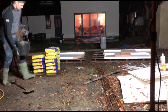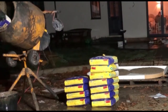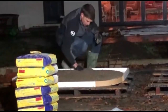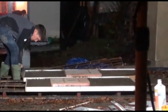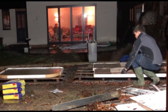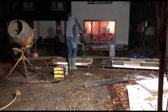I'm mixing up 40 newton bags of high strength concrete with 0.5% plasticizer and just adding enough water to make the mixture sloppy without any water pooling on top — this would be around 4000 psi concrete if you're from America. Once you've filled the molds to about three quarters full, bounce them up and down on the surface and vibrate the concrete inside. You can then add steel reinforcement to strengthen any thin sections. I didn't need to reinforce behind the sink drainer because I was using a high strength concrete mix.